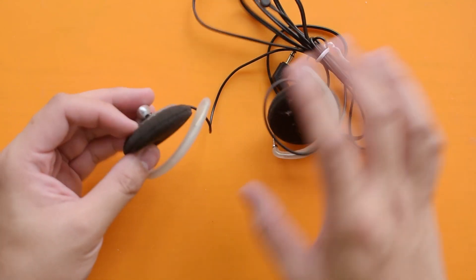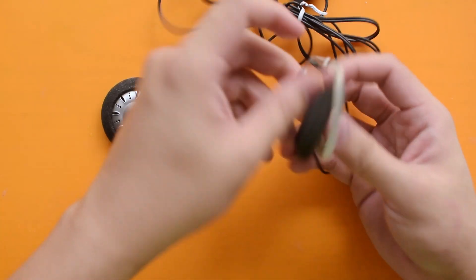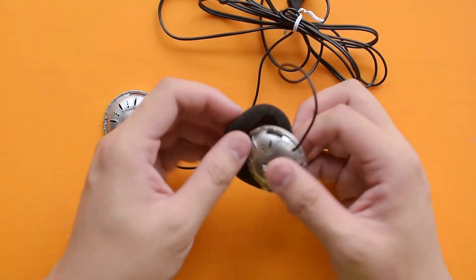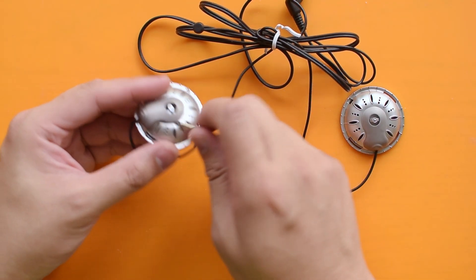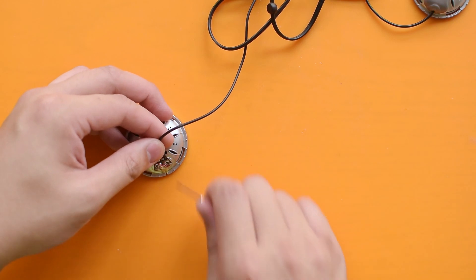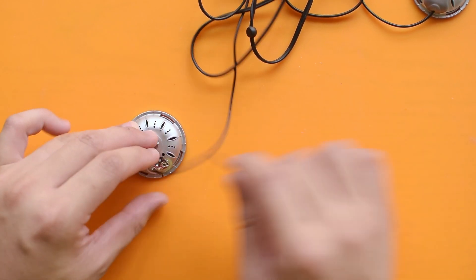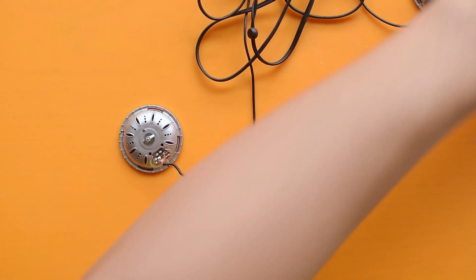Now that that's tested, let's prepare the KSC 75s for desoldering. First, I remove the ear hooks by just pulling them off, then remove the foam padding by slowly working around it. From there, I removed the piece of gray plastic above the drivers to expose the wiring and the solder joints, and carefully unsecured the cable from the drivers, taking note of where each wire belongs.